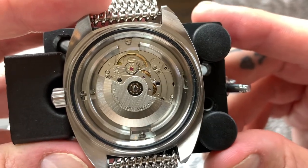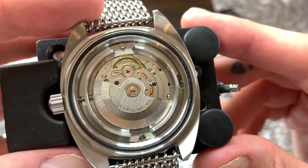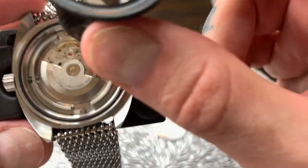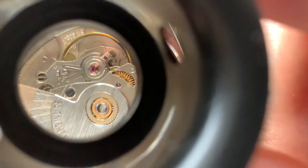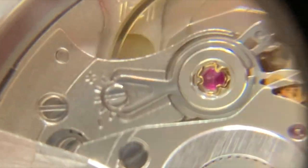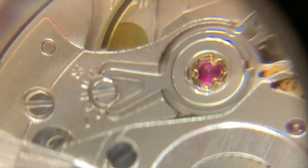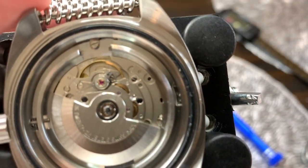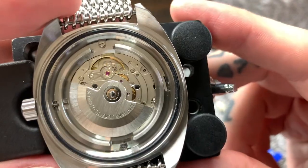That's all done and regulated before it's sent out to you. Just the fact that they do this extra step with the Core Divers really helps in the accuracy of the watch. If I get my little spyglass and bring this in, hopefully I can show you — just below the balance wheel you'll see a little pink jewel, and just to the left of that you'll see a screw head, and just above that screw head you'll see some notches and a plus and a minus. Basically turning that to the plus speeds the movement up and turning it to the minus slows the movement down — that's what regulating a watch actually means.